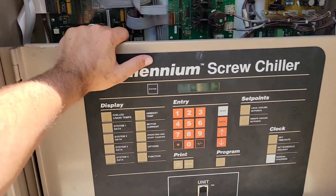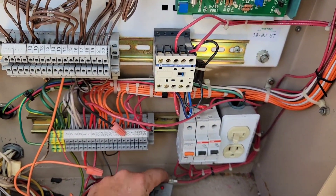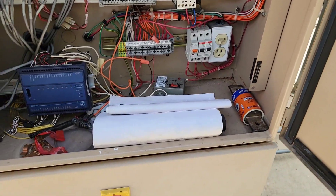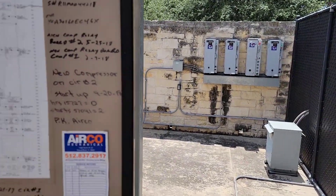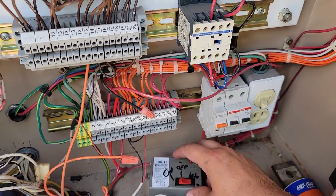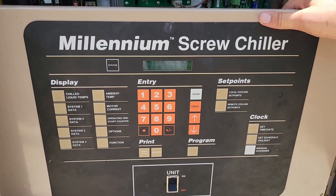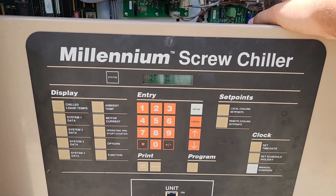So, no run permission. Let me check. We've got a relay in here running the controls. Automation is not calling. We'll let those pumps cycle for just a second. One of the things I'm making sure of is that the automation has CTs in those starters, looking for pump status. It's been several minutes now and it still hasn't engaged. We're going to just go to manual on.